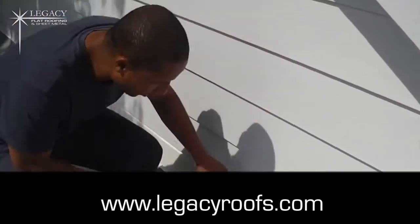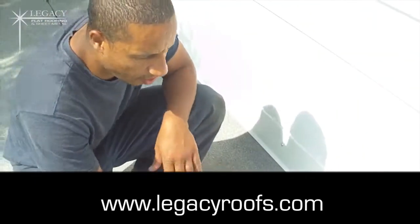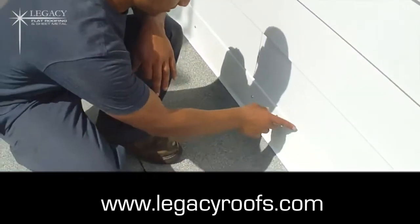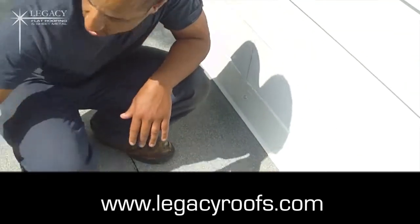So instead of lifting off the siding, because you never know what you're going to get into behind the substrate, we left the siding on. We brought the roofing up the steel cant behind that and tied it in with some drip flashing. So I think it turned out great. We have a nice water tie in there, and the water will shed down.